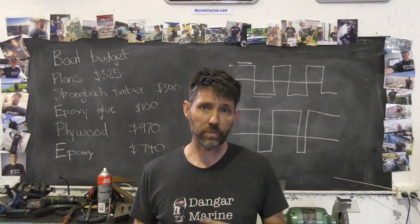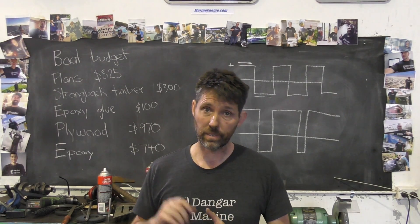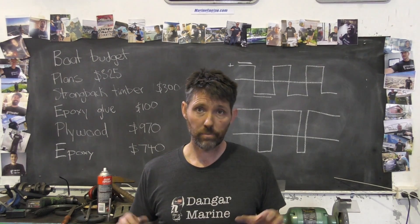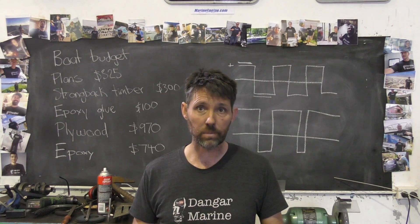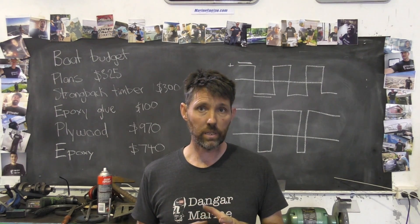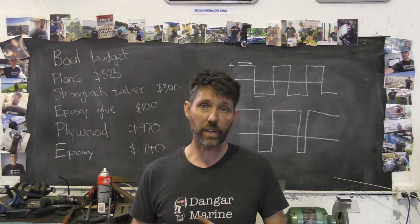Thanks for watching — I hope this video helps you if you're looking to get into TIG welding aluminium and particularly welding cracks like this. I think eventually I'm going to rename this boat 'Filler Rod' because it's had so many cracks over the years. One other thing worth mentioning about cracks: if they happen, they generally happen for a reason. In this case, many of the cracks along that chine happened because of an obvious accident the boat had at some stage. But if cracks occurred due to the stresses of normal use, I would look into welding in some extra bracing to make that part stronger — it obviously wasn't up to the job originally and needs a little extra reinforcing. Thanks for watching, take care and I'll catch you next week.